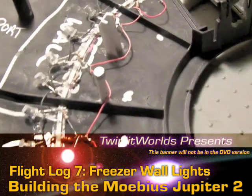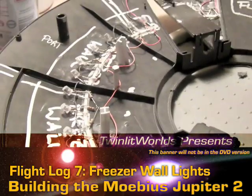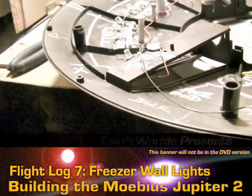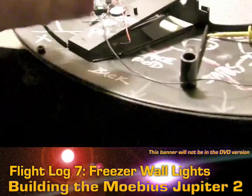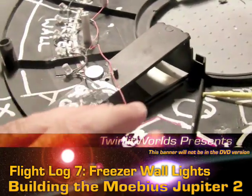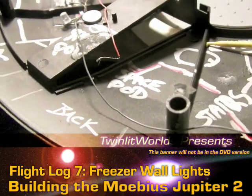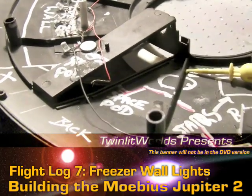Rather than doing a single wire from every LED to a bus point, all the positives are run in parallel and the negatives are on negative, so if any single LED burns out it will only be that one. Each LED has its own resistor. To change brightness levels — like if adding the blue LEDs makes it too bright — I'll put a master resistor on the power going in. This will be the white channel, and another set of wires will cover just the blue LEDs as the blue channel, each additionally resisted to finesse their brightness.